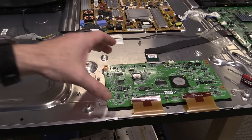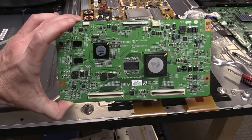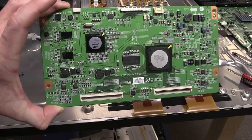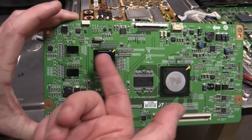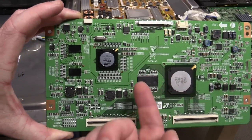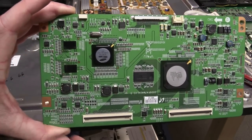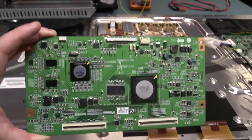I'm starting to strongly suspect this Tcon board now. I think it might be a red herring with the tapping on the processor board making it go completely away — although we did see it go completely away. The Tcon board could have a bad BGA joint under either the memory or these two ASICs. These BGA's are classic culprits for that. I've already reflowed the two memory chips here and it didn't do anything.